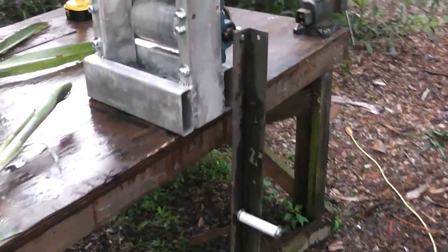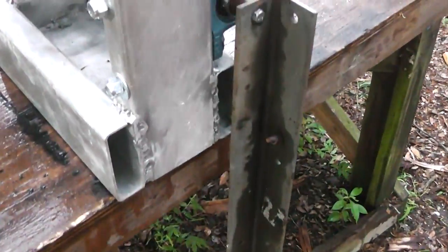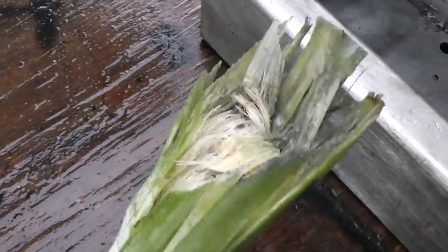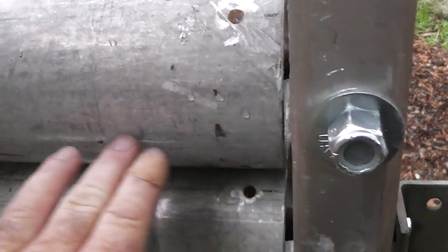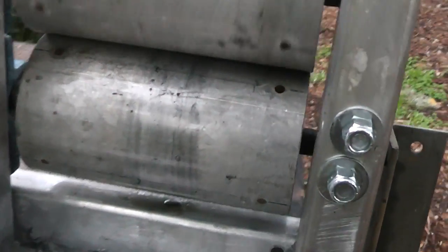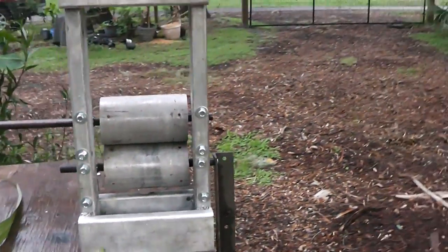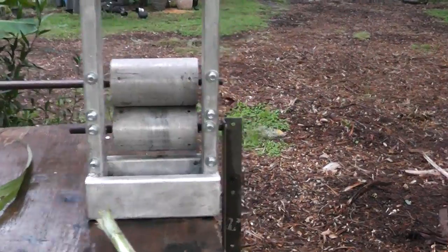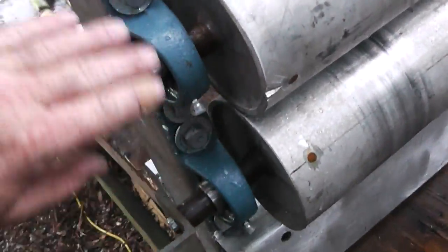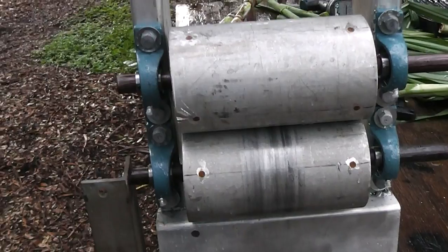I've made a much more substantial handle out of angle iron - I guess about two and a half inches by a quarter inch something like that. It really cranks on it, but I tried to stick the sugar cane in there and it just won't go - the gap isn't big enough. I also need some ridges. If I were to cut some ridges in this it would probably grab a lot better. Without having an actual grinder to look at it's very difficult to reverse engineer it properly. I need to move these bolts and put a larger space in there, then for the final squeeze move them back.